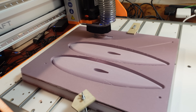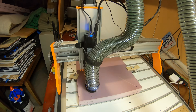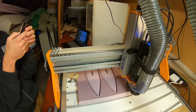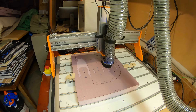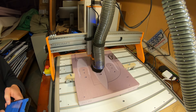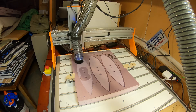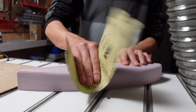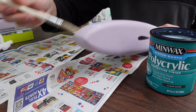Next it was time to start on the pontoons. I CNC cut these out of pink XPS insulation foam on my M1000. This was a two-sided milling operation — you do one side and then flip it over to do the other. I used little steel pins on the router bed to align the stock perfectly for the flip, which is definitely the hardest part of milling two-sided things. In hindsight, these pontoons are the wrong shape, but I'll talk more about that later. After milling, I cut the parts out, sanded the foam down smooth, and gave them a few layers of polycrylic since the raw foam is quite porous.